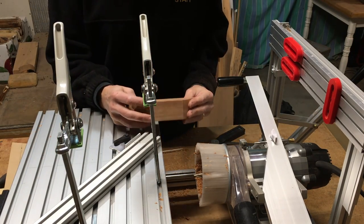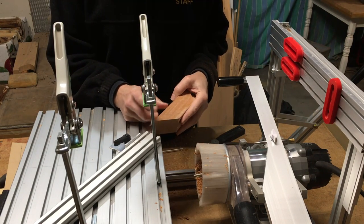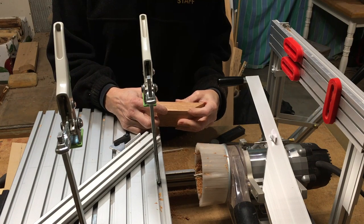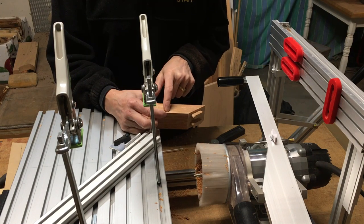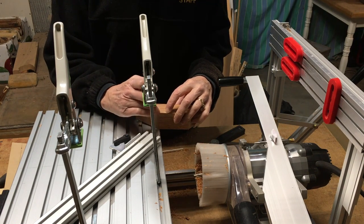When I took the back corner block over to the chair, what I discovered is that the two inches wasn't quite enough space — it almost touches the back leg in the corner. So I made that a little bit longer, to two and a quarter inches rather than two. And this is my extra allowance for the tenon.